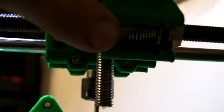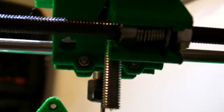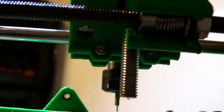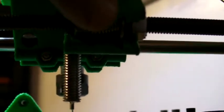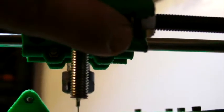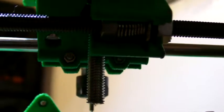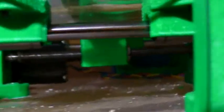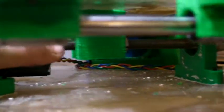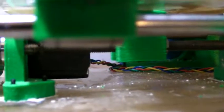The spring has to be at least an inch long. It has to be a compression type — that means it's an open spring and it acts as a spring when it's compressed. You see there's a washer, the spring is compressed, there's a washer and then there's a nut on the other side. Like I said, it keeps the X carriage from backlash back and forth. It's the same thing with the Y carriage back there — it has the exact same thing. I'm not going to take it apart to show you.